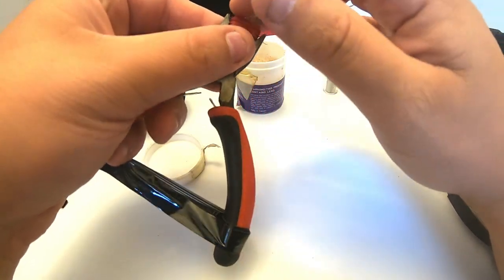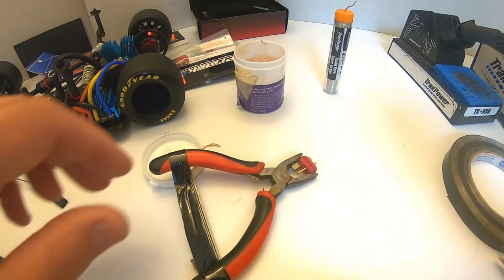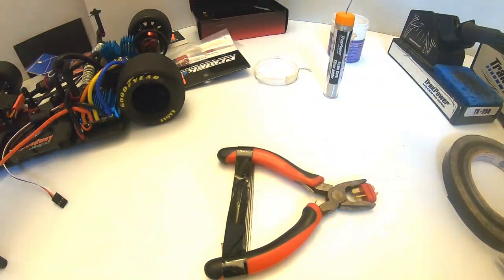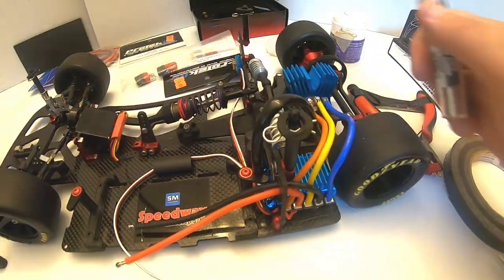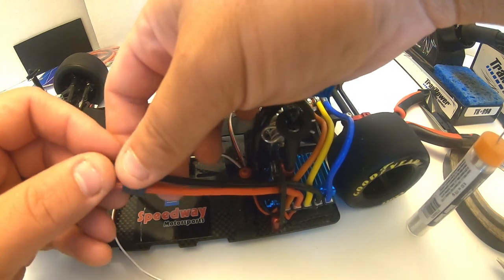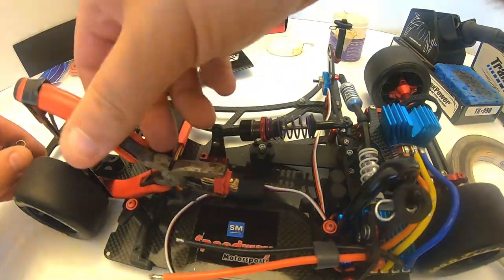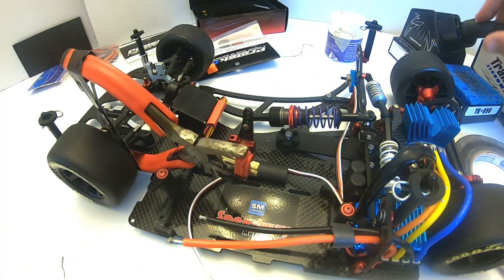That may seem high to some, but here's part of my reasoning: whenever you're soldering on an electronic device for an RC car, such as an electronic speed control, it's critical. At a lower heat setting where you're holding the iron on the board for a longer period of time, it's easy to damage it. If you run a little bit higher heat — not excessive, but a little higher — the solder goes on and holds faster, so you don't have to worry about that as much. That's my opinion. And if 700 seems a little high, it may be because my machine is a little older and I had to turn it up to be more efficient. You'll need to find what your efficient temperature is.